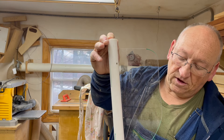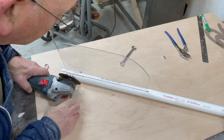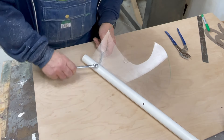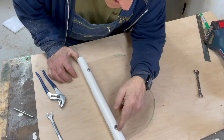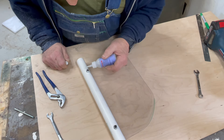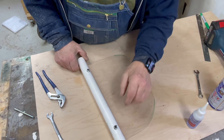Then I drill two holes and, rather than bolts the right size, I have plenty of quarter-inch threaded rod and lock nuts to fit it. Now these aren't stainless, but in fresh water you don't actually need stainless — this zinc-plated stuff works pretty good. The exposed end of the threaded rod will be a problem though; it'll turn dark. So a drop of superglue spread on it and then touched up with a little fixative will seal it. It is sealed.